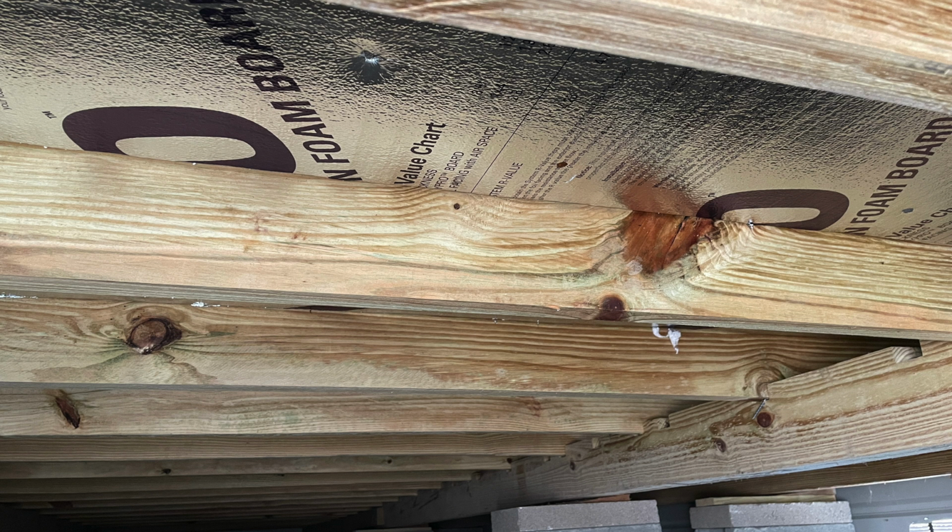So I didn't talk about this earlier, but think about your floor insulation. You can, when you're designing this shed, have them blow in that, I think it's closed cell insulation, but it's really expensive. So if you want to do that, there's a couple of different ways. You can raise your shed up high enough to get underneath of it and put the insulation in yourself, or you can do the blown in insulation yourself as well. I think they sell that at the big box companies.